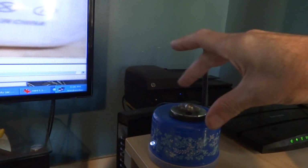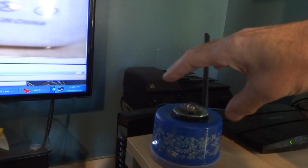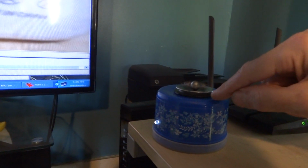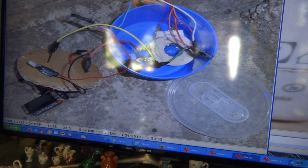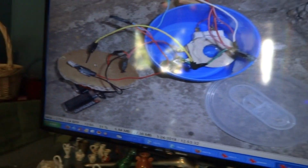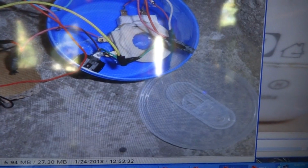Now once I got it broken off, I could take the lens out and turn it around the other direction. Then I used the part that was originally the back side of the reflector. I glued this lens, now facing the right direction, onto the back side of the reflector. And to show you what this thing looks like inside here, there are the two synchronous motor coils that are sandwiched together. Okay, I have my transistor glued onto a piece of wood over here, the rocker switch here. Here's the LED. I haven't put it in the hole that it goes in yet.